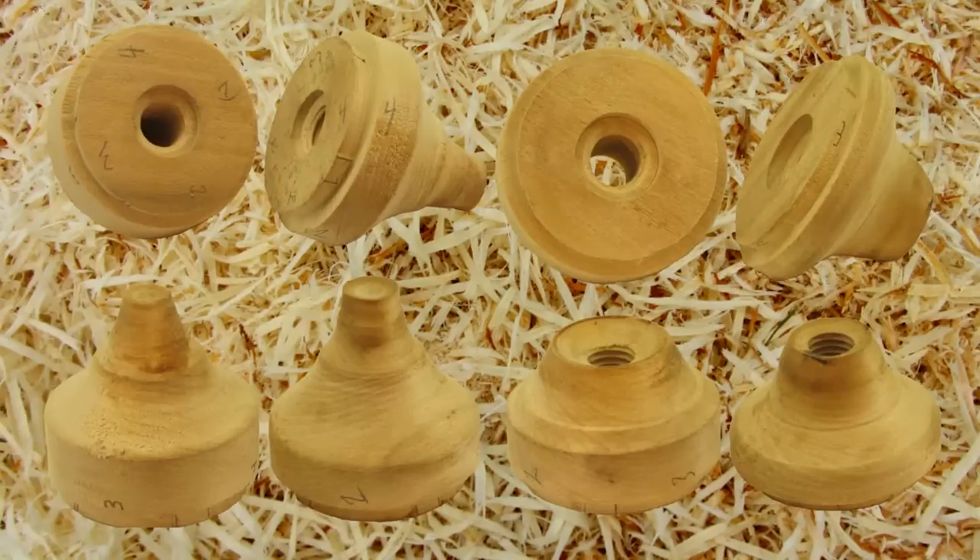The other faceplate is nearly identical. The second faceplate set for smaller balls has an additional layer of poplar glued onto its face, which allowed me to turn the cup for a ball smaller than the ¾ inch threaded cup. Part of conquering my ball-turning phobia is to have the right process, and this process includes simple faceplates that cost much less than a dedicated single-purpose jig.